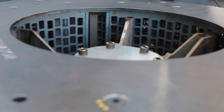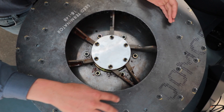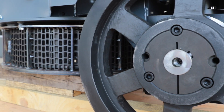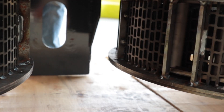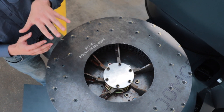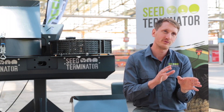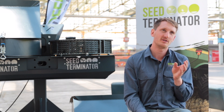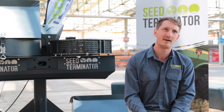The multi-stage hammer mill is our core technology, and it's really that aero impact that makes it unique — it's able to pass through the air in an efficient way and doesn't create too much turbulence or waste heat. We've optimized the particle flow through the mill to reduce wear, coated the weakest links in tungsten carbide, and hard-faced certain components. A whole series of metallurgical changes and geometry improvements to reduce over-processing of material has enabled a 31 percent reduction in power.